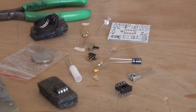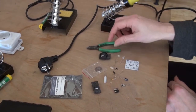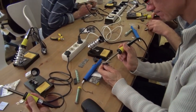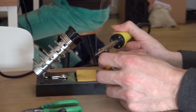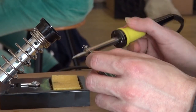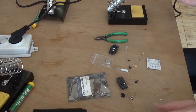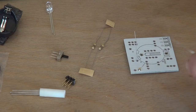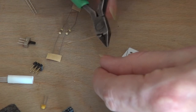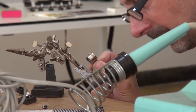Why don't you open up your bag — you can just nick it with the little wire cutters. But if you solder, you will burn yourself. The first step of soldering is to clean the tip. We need to cut the excess leads off. We want to cut with the tip of the wire cutter — that gives us much more control.